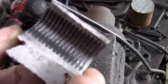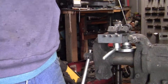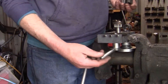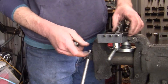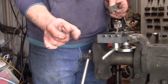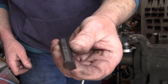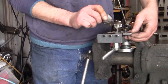The lead screw looks really good and the nuts don't look bad. I got them all ready to go — they're both the same. I took a file and got the burrs off. There's our half nut handle, and these just fit down in — they have a slot and this just slides in. Then there's a wedge, the other half of the dovetail, and it just slides in there between that dovetail.